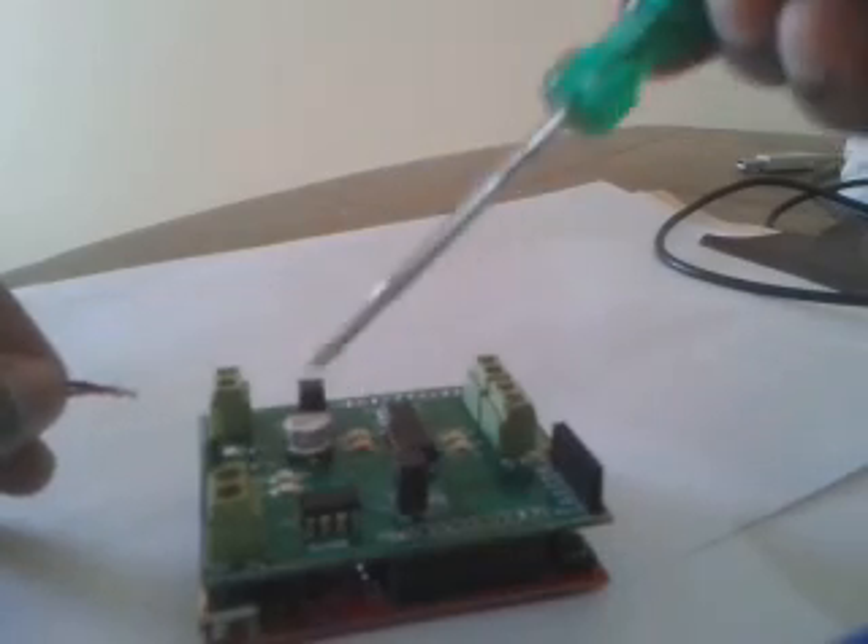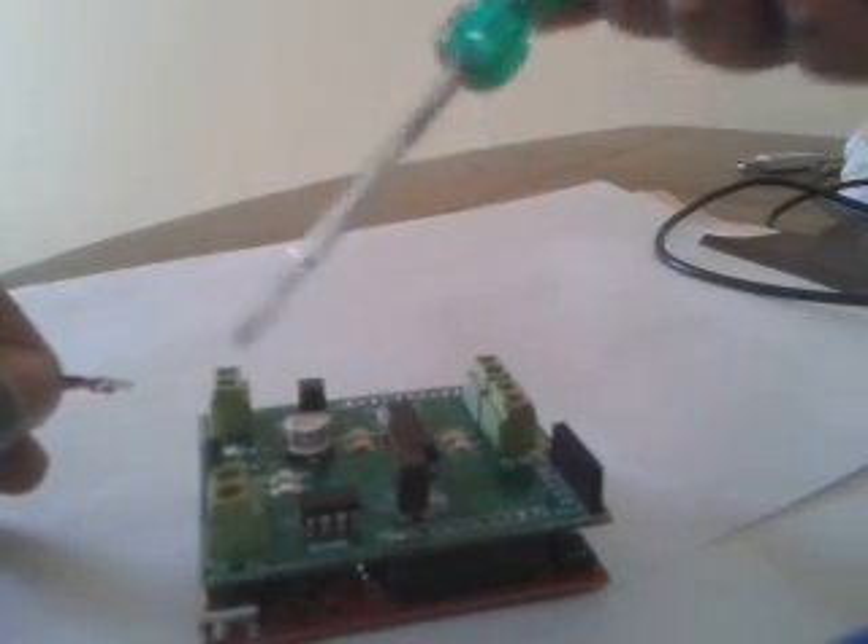Now providing the power supply — you have to use a 12V DC power supply. I am taking the power from my DC adapter. Polarity should be observed correctly. The power terminal is labeled P2 while the other terminal is for RS485, so don't mix them up.